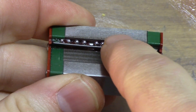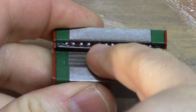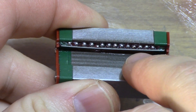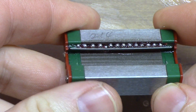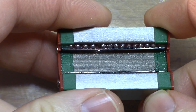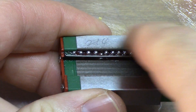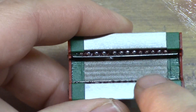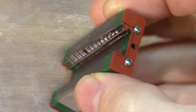Here's our carriage after packing both sides. Don't be alarmed if you have a small gap — that's because there is one less ball than necessary to keep a little slack. If this was an official HiWin unit there would actually be a lubricating bar here, which is how those keep lubrication up. For cheap Chinese rails it may look like we have a lot of grease packed in, but that's because it needs to distribute across all the balls and the railing, so it's okay to over-pack it a little.